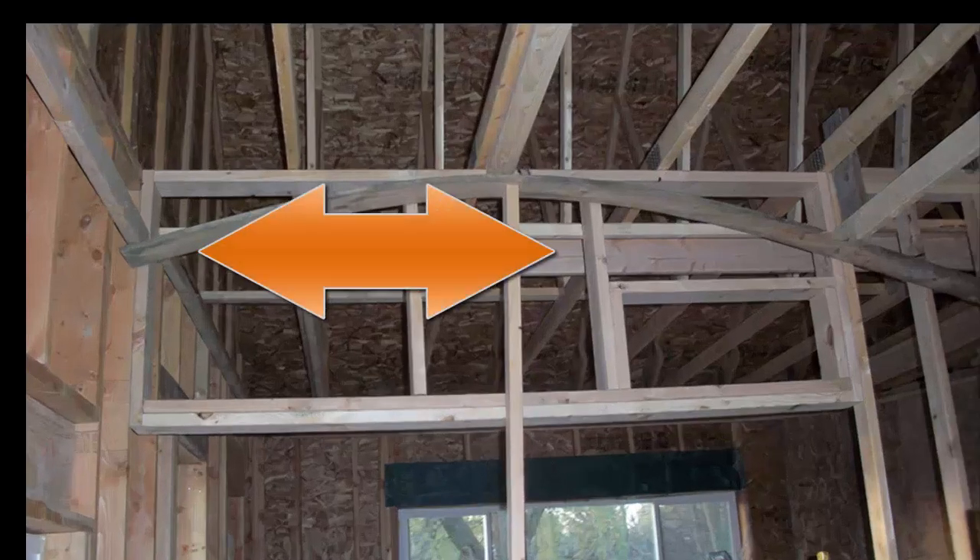To build an 8-foot wide barrel vault ceiling, I used 1x6 pieces of pine. I put the 2x4s against the two end walls and two sidewalls about 7 inches down, which is the maximum I could raise that 1x6 without having it snap, because I did not cut any kerfs in it.